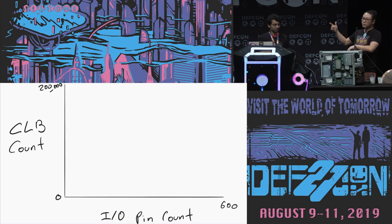By reversing, we mean you take the bitstream, and the goal, for the most part, is to be able to recover the hardware description language and underlying logic that went into generating that bitstream. And once you have that, and if you did that 100% correctly, you might be able to modify that logic to have it do something different than its original design, and then you have to run the whole synthesis tool, right, and regenerate the bitstream, redo the optimization and routing, and then regenerate a bitstream.